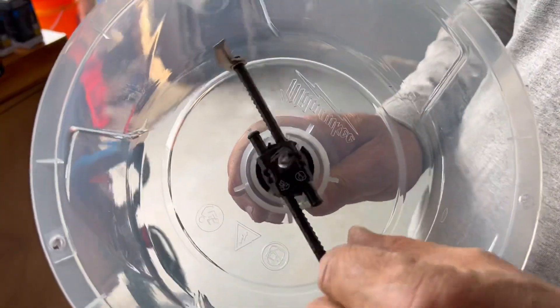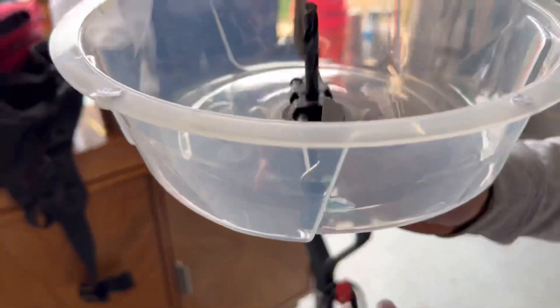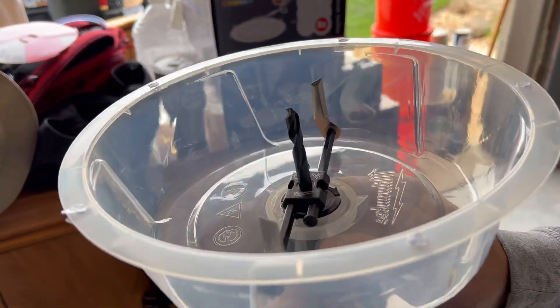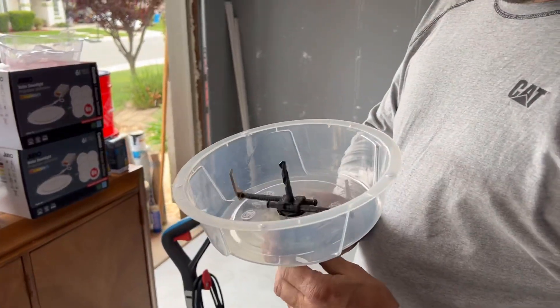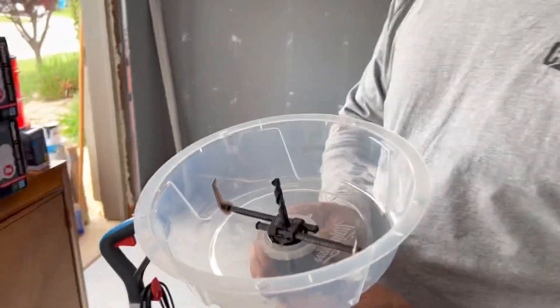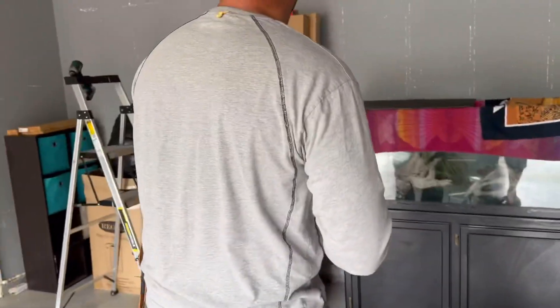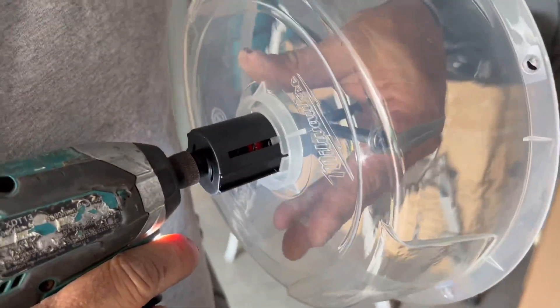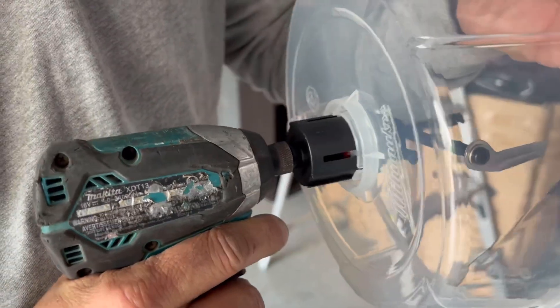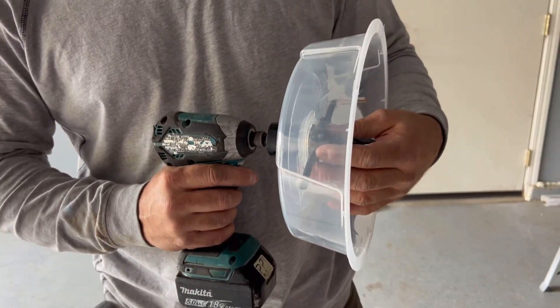What is this? I didn't even know you picked this up. 'This is a hole saw kit. You can change the dimensions by bringing these in — we have it set for six inch, and all the debris falls into this. You chuck this into your drill, stick it up against the drywall, and the center of your grid goes right here. As it spins it cuts out the drywall and drops into here — it doesn't leave a mess in your face.' That is cool man — so that's specifically made for putting in can lights. It's a Milwaukee brand adjustable hole cutter, about $34, and we got it at Ace Hardware. This cups against the drywall and as you push against it — oh, spring loaded! So no debris gets anywhere.